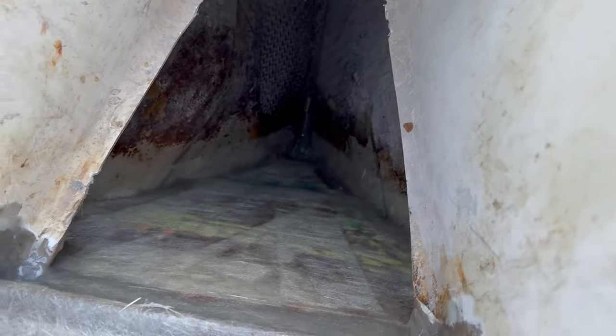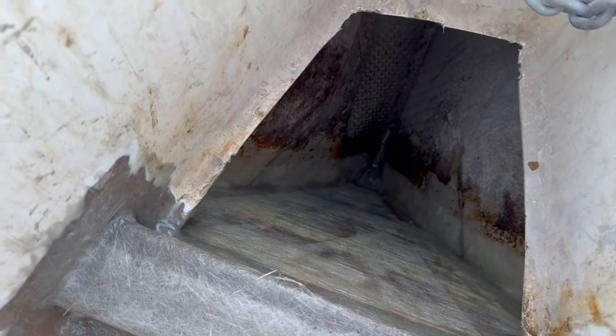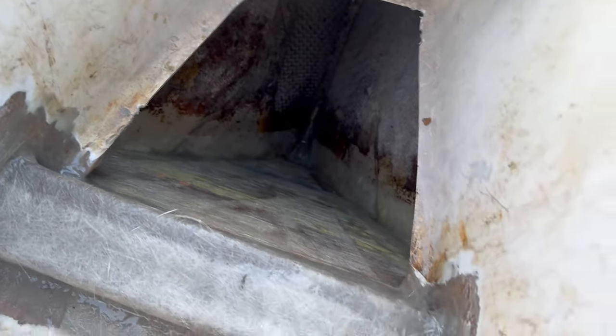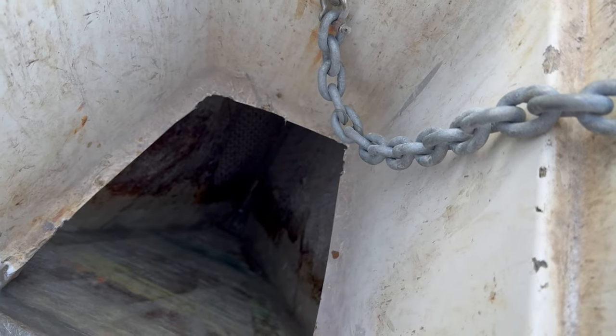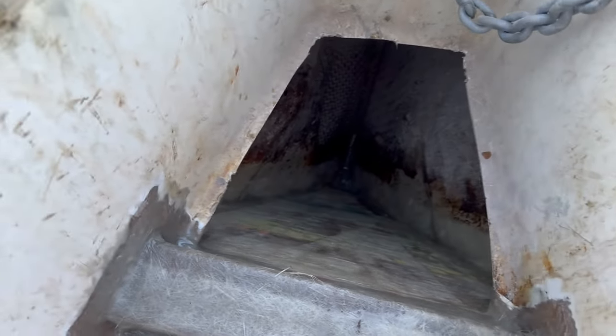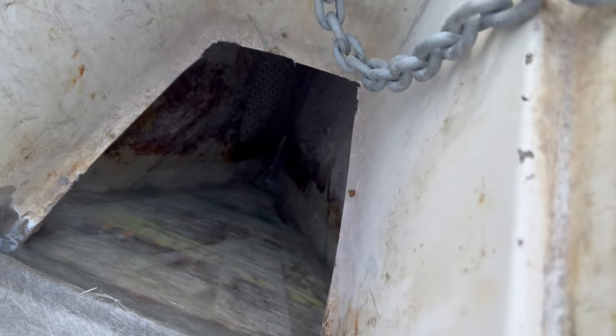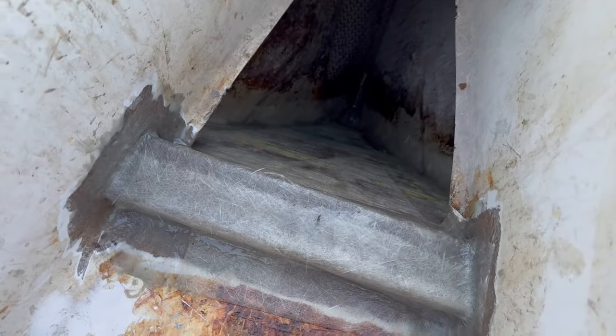What I'm going to do is let this dry, then I can use the inside as a template to make some triangles of fiberglass, putting single sheets in there bending around the edges as well. That's the idea. Once I've done that it will get sanded down and gel coated so that it looks good. It's getting there actually - I'm quite pleased with what I've done so far. Yes, it's still work in progress and still looks a bit of a mess, but it's not bad.